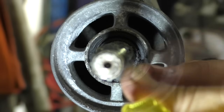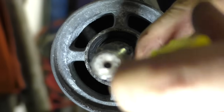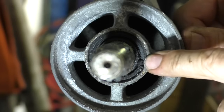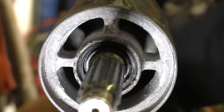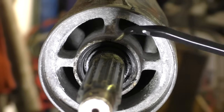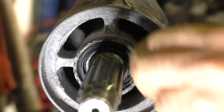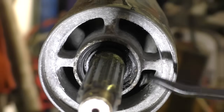What I'm going to do is get a screwdriver between this casing and the oil seal and pry it away from the wall a little bit. This will definitely put little scratches in this casing. But as I said before, that's nowhere near as problematic as scratching the prop shaft itself. I'm going to use a variety of tools, from a standard flat blade screwdriver to this, which actually came as a part of a gasket removal kit, a little bit of a hook. In here you'll see the spring here that holds tension on the inner part against the moving shaft.